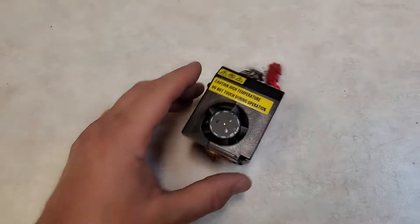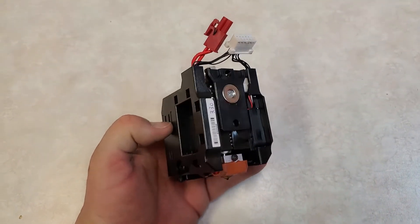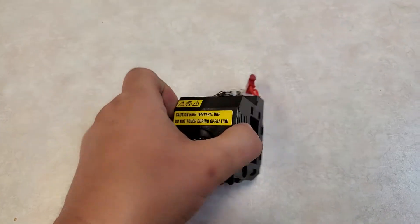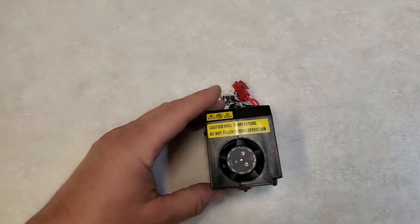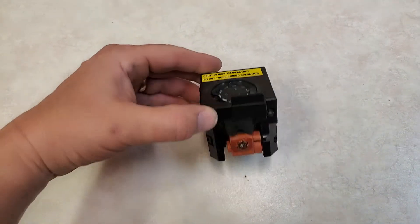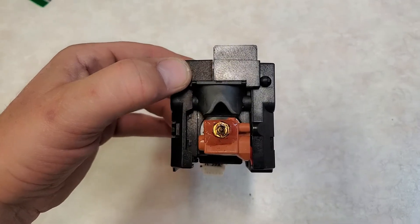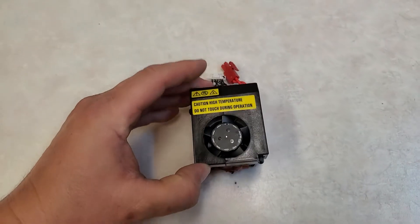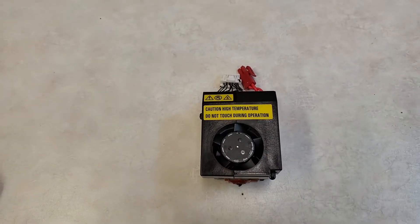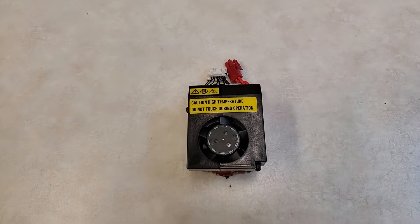This, as you see, is a nozzle cartridge which is actually very easy to replace — two connectors, magnetic mount — but the nozzle itself is brass and wears out. If you want to do any kind of abrasive materials like glass-filled nylon, a brass nozzle really isn't going to do any good. Couldn't find any information about how to replace it, so I'm going to do a little destructive testing and find out how to do this on my own.